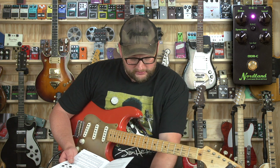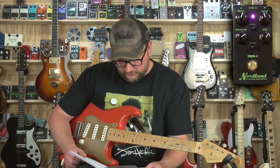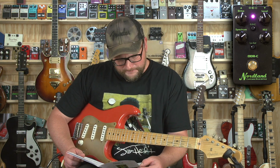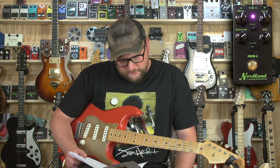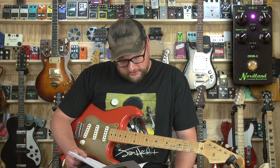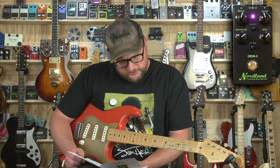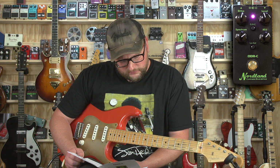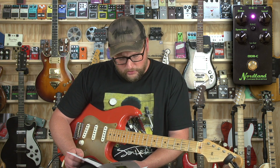It's primarily the lower three knobs to the low right: your mid control, your ODC, and your low cut. The ODC knob will decrease the amount of overdrive compression technically occurring in the overdrive process. You have a low cut knob that controls the low frequencies out of the signal, and then your mid knob will give you control of the mid-range.